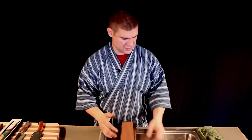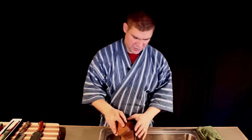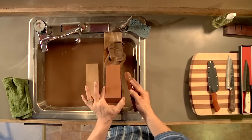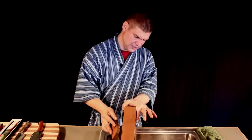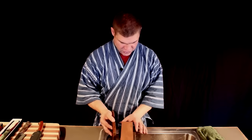But now I'm a little bit more mellow in how I view the maintenance of the stone, and so I'm no longer opposed to having a second old, kind of worn out stone that every now and then you can look at and use to grind the surface of your stone a little bit. It does 2 things. It just makes the stone a little easier to use, and I actually take pleasure in sculpting and shaping the stone back to a nice flat shape again.